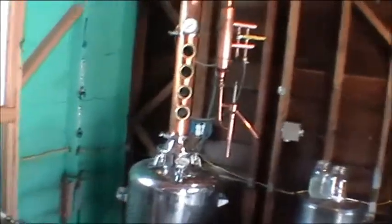This would basically take a 300-square-foot property currently being used for an alternative use. You can see over here we have city water and well water feeds for cooling the still. Everything has been wired for 20 amps — that's what the yellow wiring is. I like to overdo in terms of wire gauge because it's always safety first. We've got a new circuit breaker panel, all new outlets, and lights temporarily hung up.